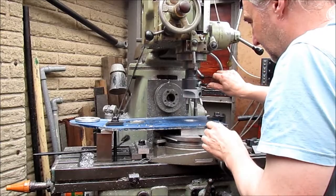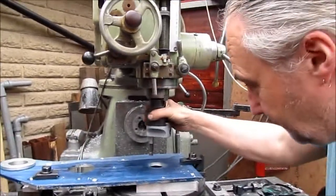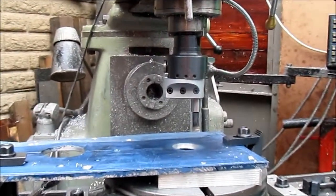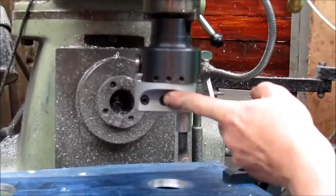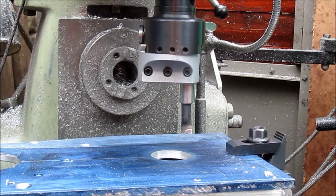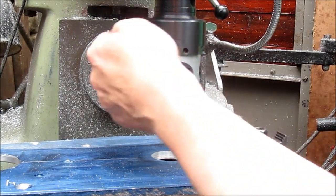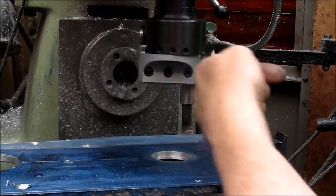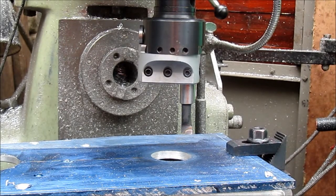After about another 20 cuts. Let me zoom in on that tool so we can see how it works on the borer. That's your borer cutting tip on a sliding dovetail joint, so as it spins round it makes a hole. And as you turn it down it pushes further out, so it bores a bigger hole.